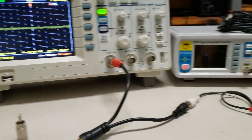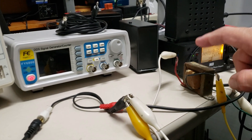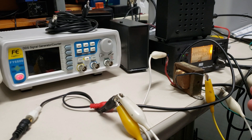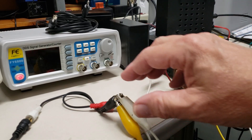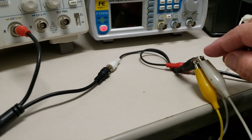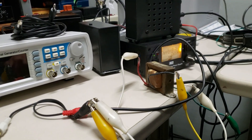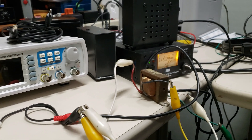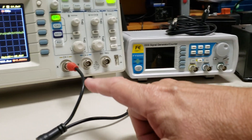So a quick rundown. The output of the receiver is going directly into this old tube-type audio output transformer. It's going into the low impedance side, which I think is around eight ohms, maybe four ohms. And then it comes out probably 10,000 to 15,000 ohms. Then we're going into some cables here, and tapping into those cables feeding this into a little audio amplifier. The reason for that is that the transformer mismatches the impedance for a speaker, so you can't go directly to a speaker — you have to amplify it. And then we have a scope here to show the waveform.